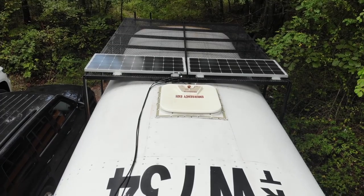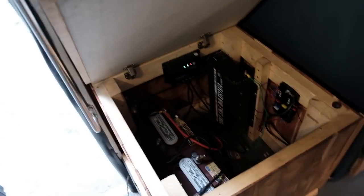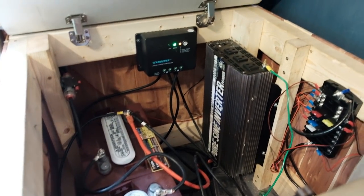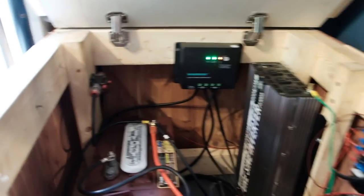And what do you got on the roof, too? Yep. We got 200 watt solar panels that are powering these right here. This is the money maker. We've got a nice inverter coming off if you need to run anything off of that, but most everything's going to the fuse panel. And two deep cycles? Yep, two lead acid. You're not supposed to run lead acid inside, but they only off gas every 30 days, so I'm taking the risk. Right on. Your sine inverter, nice.